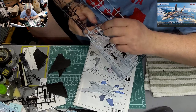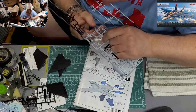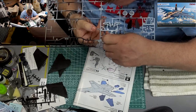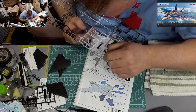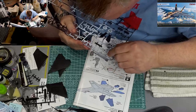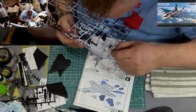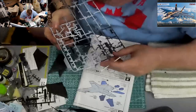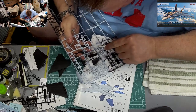And that, of course, also a bit of the nature of hydraulic systems. They tend to weep. You guys know what weeping is. It's not leaks, but when you're working with a high pressure hydraulic system, you just get a tendency to have a little bit of fluid just kind of, the only description really is a weep. It's not an actual leak.